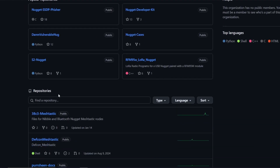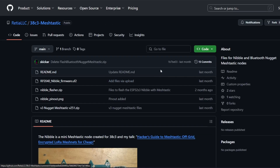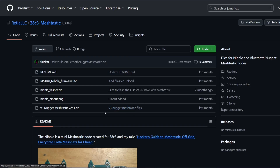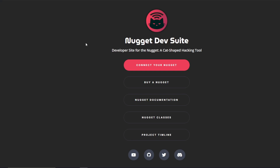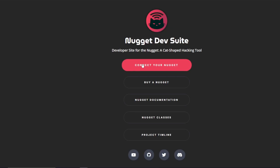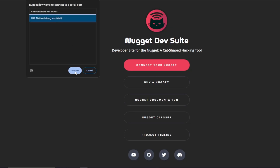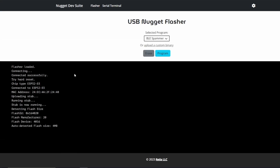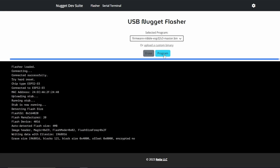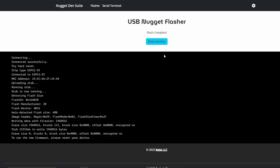And with that your Nibble should be fully assembled. But before we can get started messaging anyone, we first have to flash our microcontroller with the correct firmware. To do that, navigate to the Radia GitHub and download the Nibble firmware zip file — we'll put a link to this page down in the description. If you're using the ESP32 version, navigate to nugget.dev, which is our web-based firmware flasher. Hold down the B button while plugging in the board, then click 'Connect your Nugget.' Select your Nibble from the dropdown list, click 'Upload Custom Binary,' and select the firmware-nibble-ESP32-S3-master.bin file from the folder you just unzipped. Once the file has finished uploading, unplug and re-plug your Nibble to start using the new firmware.